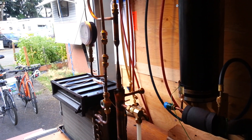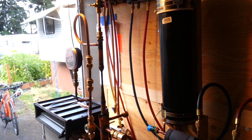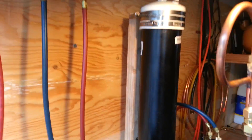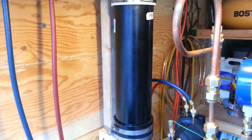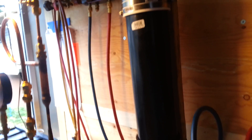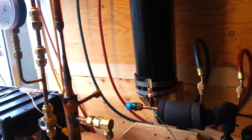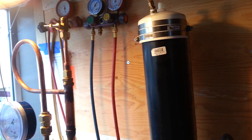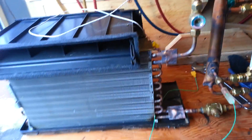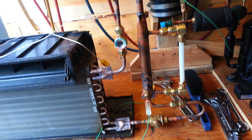I chose not to go with the air-cooled condenser for a number of reasons having to do with running copper outside, having a more permanent setup, longer runs, and more use of copper. I intend to have a heat pump built for this fall which is going to use water as the medium to carry heat into the house, so it's about time I start to fool around with that. I'd also like to put thermocouples on the inlet and outlet of the water heat exchanger so I can measure the temperature difference and, knowing the flow rate, get a better idea of the change in enthalpy of the refrigerant passing through it. That's about it for the setup at this moment — hopefully this evening I'll have the rest of the lines installed. Thanks for watching.